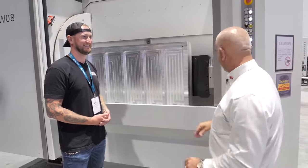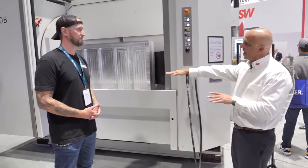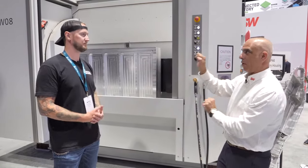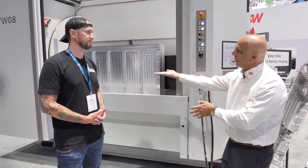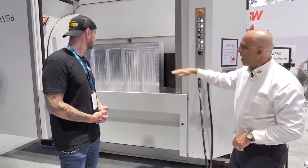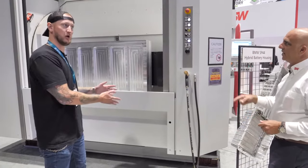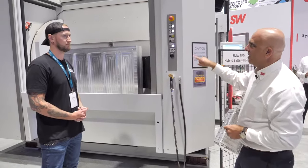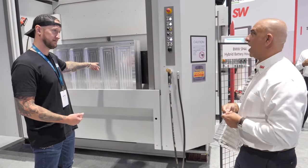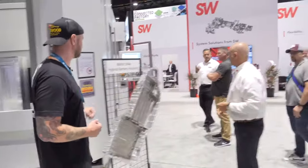You can see this big aluminum block — we're cutting out a dummy profile of a battery tray, about 25 percent of the way through the process. By the end of the week we'll have cut four profiles completely representative of a battery tray. The part gets loaded here and this entire table rotates into the machine on the other side. The flat orientation makes it very easy for an operator to bring parts in — gravity is working with you, not against you. When we're loading out here, we're machining on the back side, so you have no downtime. That large table rotates in four seconds.